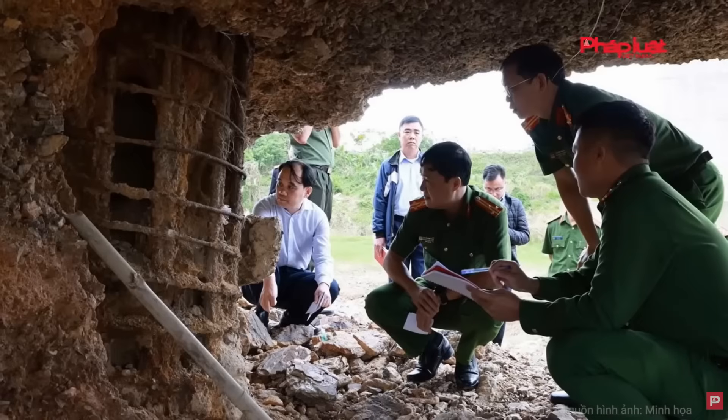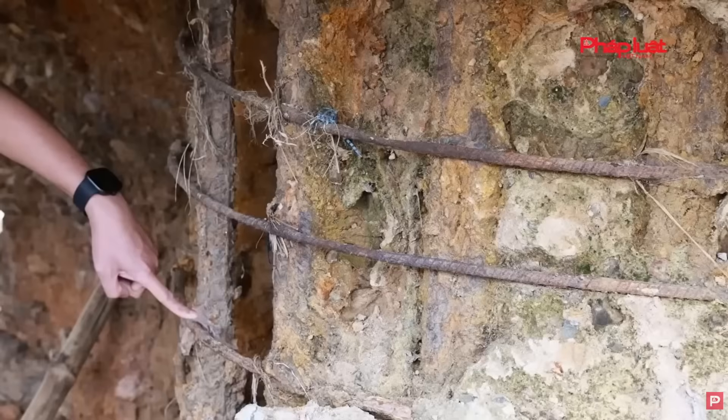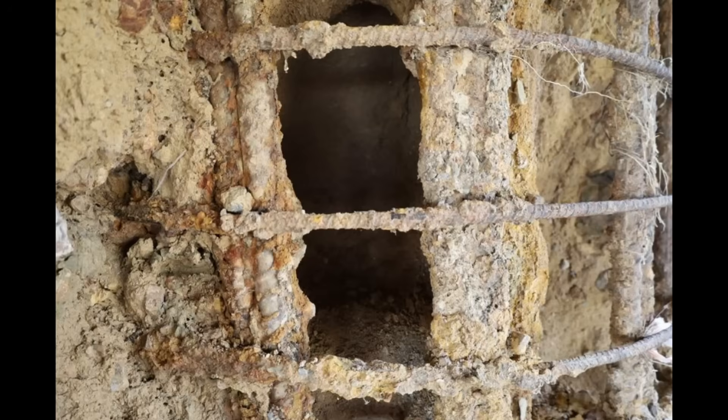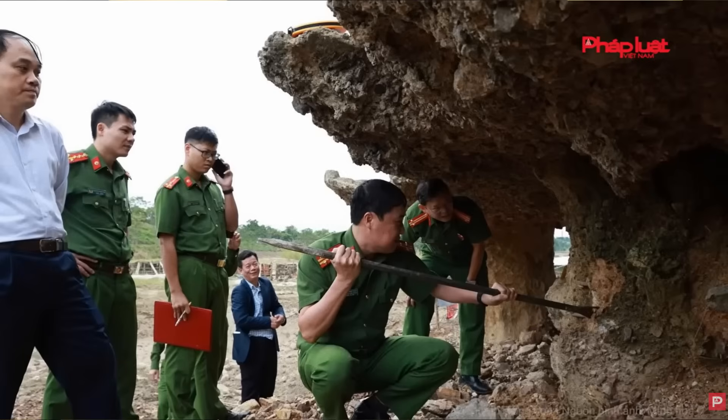You can see large voids to the interior of the main reinforcing. I've seen this on projects before, and this is a result of contamination of the concrete during placement. These drilled shafts were constructed in the wet — the groundwater level was probably near the surface — and there was undoubtedly mixing of contaminated water containing soil with the concrete during placement. The cement paste washed away too. You have much less structural integrity and much less strength than what was expected for the design. At one time, the outside of these drilled shafts were covered with soil, and I think it's entirely possible that during construction they had no idea of the contaminated nature of these foundations.